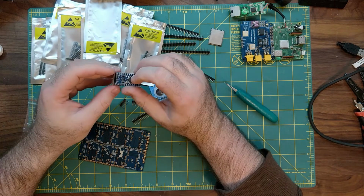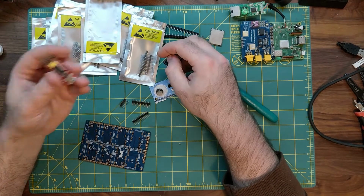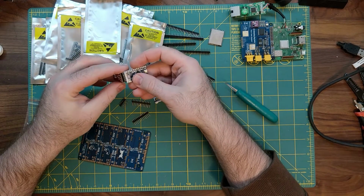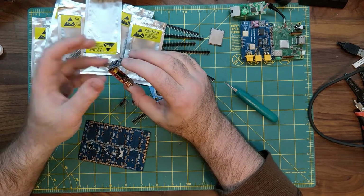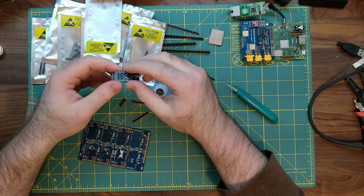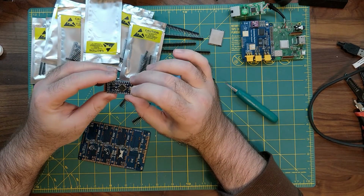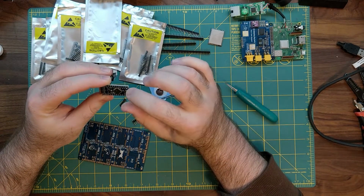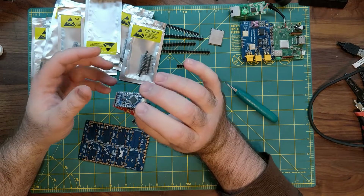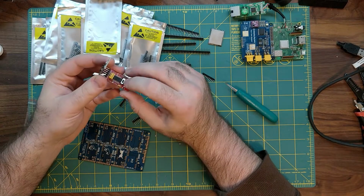And then right before we put this on, we'll connect the FTDI connector to our computer, making sure that the 5-volt is turned on. We will slide this into place, and we will preload, and then we will hit the flash button. And it only takes about 20 seconds for it to actually load. And what you can see, if you've done it correctly, is that there are LEDs on board which will flash very furiously back and forwards when it's doing it correctly. Sorry, not the Arduino board, but the FTDI board.